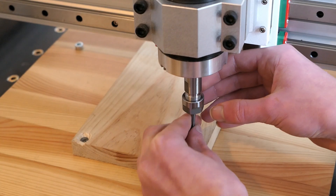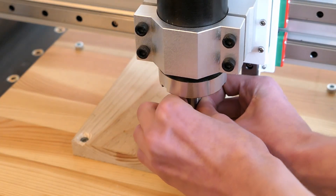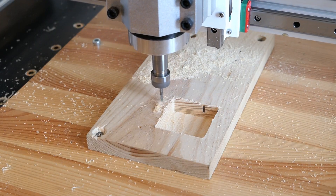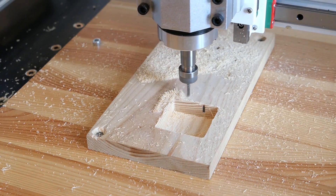After another little dry run, I added the endmill, which is also the same as in the last video. By now I just hand tightened it — which will work fine, there is no way this will cause any problems. As it turns out, the endmill moved down a bit, causing the machine to make a deeper cut than intended. Apparently it's a good idea to screw things tight — who would have thought?